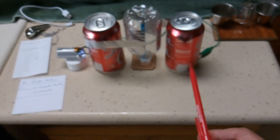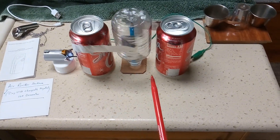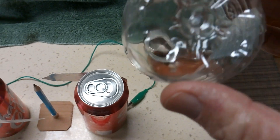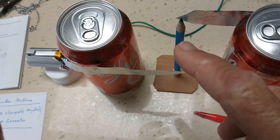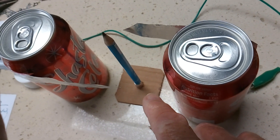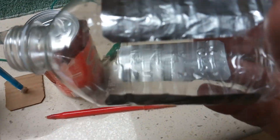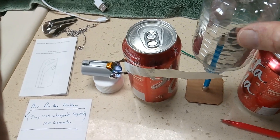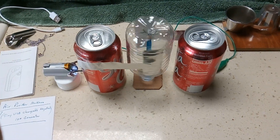One of the reasons for this video was this little motor here — I threw it together in about 30 minutes to show you how you could set up a quick electrostatic motor. All this is is a plastic bottle; there's enough of a dimple down in the bottle for the pencil to run on. That forms the top bearing — it's just a pencil stuck through cardboard, sitting there. These are just pieces of aluminum foil taped to the side of soda cans, and this is aluminum foil here. You can make as many segments as you want — I put four on here — and it works really really well.